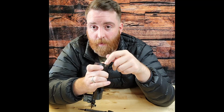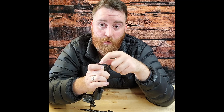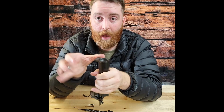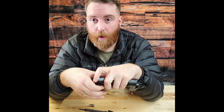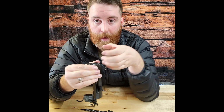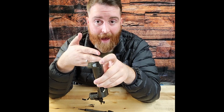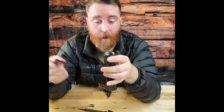So if you want to do prefits or something like that on here, which I do know one company is making prefits, actually BSF, because they make the barrels for the Weatherby rifles that they sell, holds your recoil lug in place. That way when you screw the barrel on, the recoil lug doesn't rotate and it's not clocked with the action. And then you go to put it in your stock and it hits the bottom of your recoil lug pocket. The other thing is it keeps the recoil lug from being able to basically shift in between the barrel and the action, under recoil, which can cause point of impact shift, and then your zero is off, and then, in the middle of a match, you're like, oh, why is my dope off?